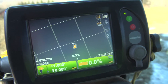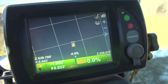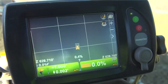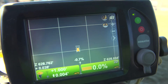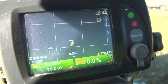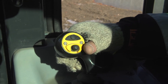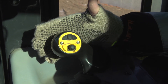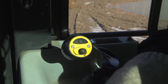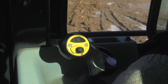You can see the number is staying. There's a one-foot offset in there. You can see the elevations changing, but I'm completely not touching the blade. It's taking complete control out of your hands. I keep my hand on the blade control until I put it in full automatic — one click of the button on the controller, I push down on the blade, and that's it. The blade fully takes care of itself from the project file on the monitor. I do not have to touch the controller anymore.